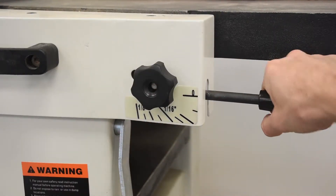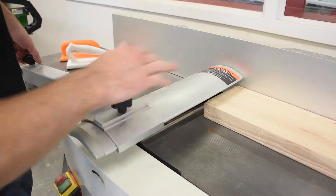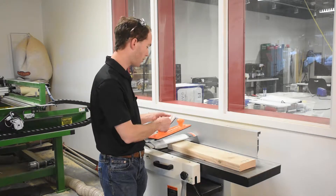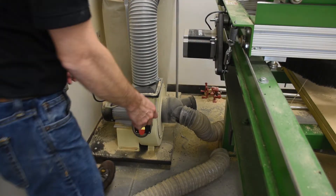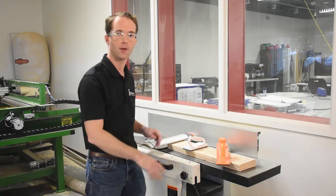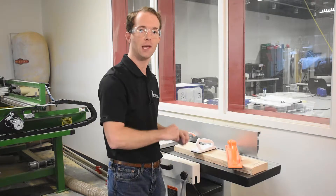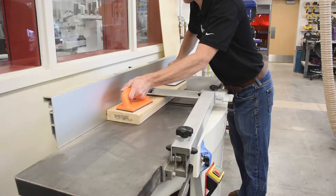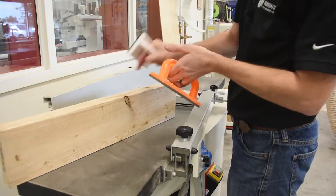Now to set this up, I like to go back to zero on the depth, and then come down to what I want. You can't do more than one eighth inch per pass. Now I'll adjust the guard so that the wood will just barely clear. And I'm always going to use push blocks, even though the cutter is covered by the wood and the guard. You just shouldn't take any chances with this machine. Now I'll turn on the dust collector in the corner of the shop and make sure that the correct hose is connected, and plug in the one for the CNC router to increase the suction. Safety glass is on and push blocks ready. I'll turn on the jointer. I'm going to feed it slowly through and push down hard to keep it flat. Now I'm judging my cut by the sound. You'll hear the blade not cut in the middle of my piece because it's bent upward. I'm going to make repeated passes until I hear the same sound and feel the same amount of resistance all the way through across the wood. Then I know I've got it flat.